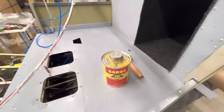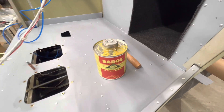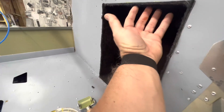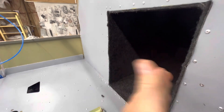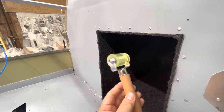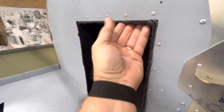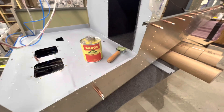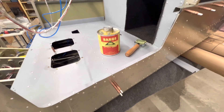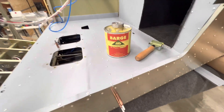I also did the center console. I bought one just to see if I liked it, then decided to do all the carpet with it and bought two more. It's contact cement: you put it on one surface, put it on the carpet, leave them separate to dry a bit, then push into place. I bought a roller on Amazon for about five bucks to apply a lot of pressure. I did this late last night and it's tight - it's waterproof and designed to glue shoe leather together.